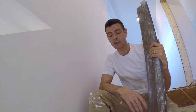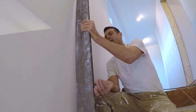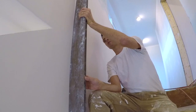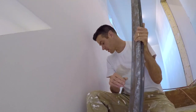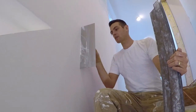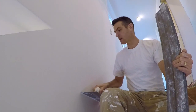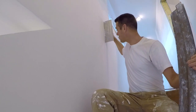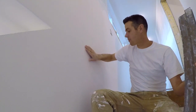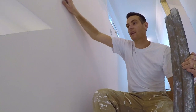Now that it's sanded off, it's going to get one last coat. Let's take a quick look — it's not perfect, I didn't make it perfectly flat, but I gave it the appearance of looking flat. I can see there's sort of a one-foot flat range, but it does still rock over the four foot of this Darby. But when I take a 14-inch trowel and go just about anywhere, it's quite flat. Over about one foot to 14 inches, it's totally flat — you move your hand around and you can't feel any speed bumps anywhere. Nice and smooth.